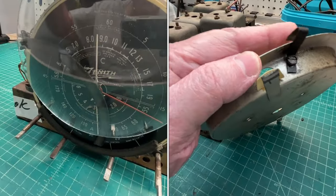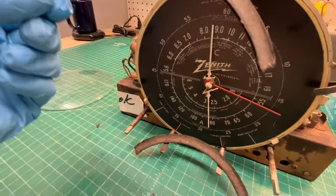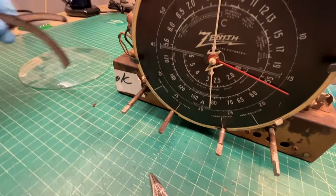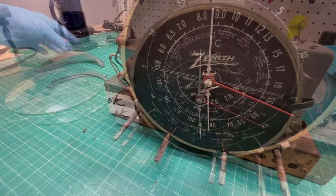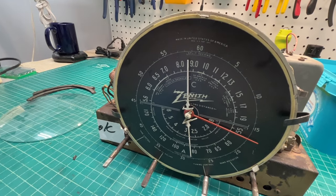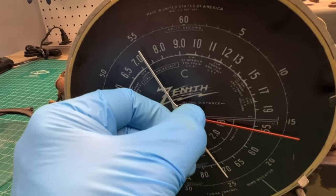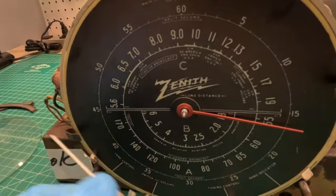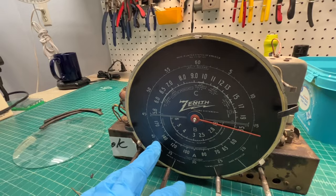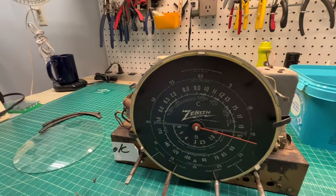I can just slide this out and set it aside. What's left of the old gasket that went around it — I'll fabricate a new one, probably made out of felt. I should be able to remove the dial pointer now. The beautiful dials on these Zenith radios should just pull straight off based on my previous restorations. Let me remove the second one, then get the dial scale out and remove the retaining screws, then back over to the tuning condenser.